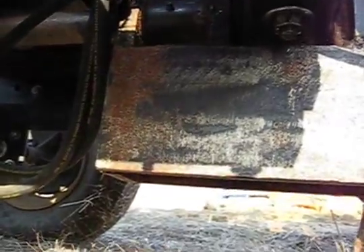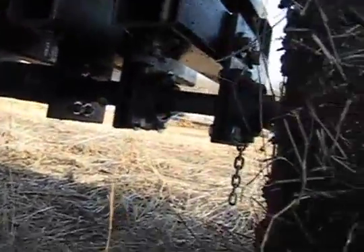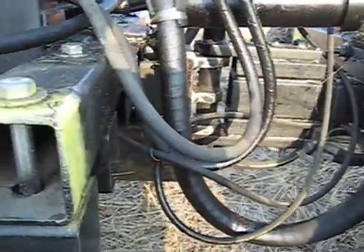Now look at this joint detail here. There's a rotating shaft that goes all the way to the front of the tractor, which spins this joint allowing the back wheels to rotate up and down so that they stay on the ground at all times. This is just stiff reinforcement added after the middle joint cracked — it was totally reinforced to a much stronger configuration. This is actually welded here, which is cheating again. I had bolts initially but I welded that because it's the critical feature you don't want to break.